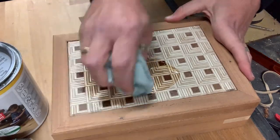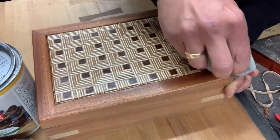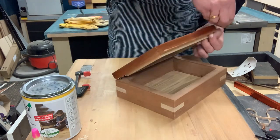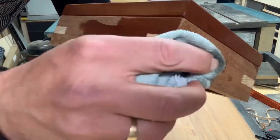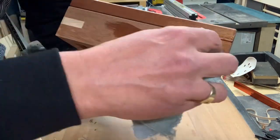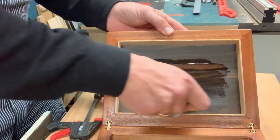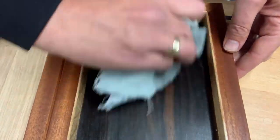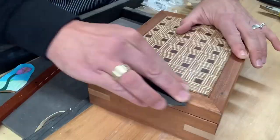Two coats of Osmo going on now — my process is to wipe it on nice and thin, wipe off the excess as I go, then rub down lightly with 400 grit sandpaper between coats before the second coat goes on. I'm really pleased I stuck with this project even though it wasn't perfect — that's almost part of the design charm. This wood came out of my friend's original house before he started extending it, so hopefully it's got a little bit more meaning for him. I think it looks beautiful and I think he likes it too. Let me know what a jelly roll is because I haven't got a clue — thanks for watching!